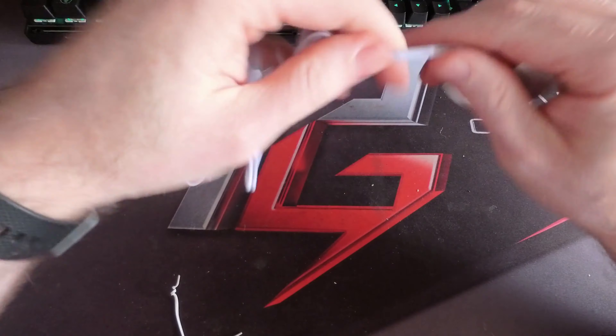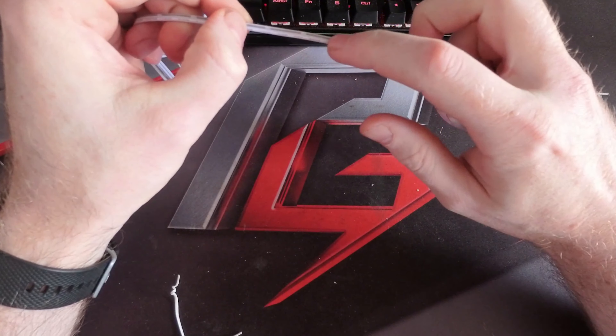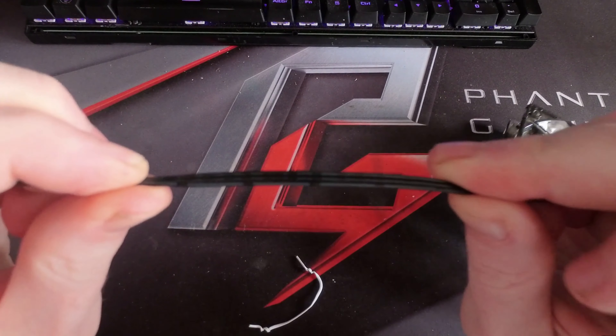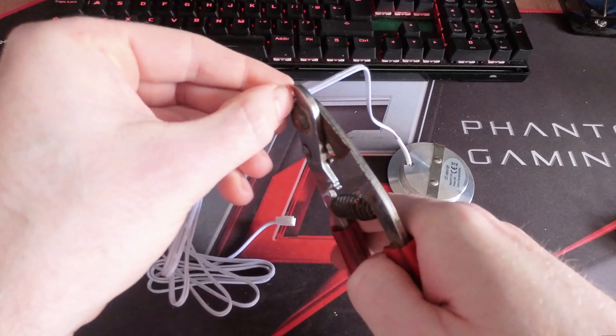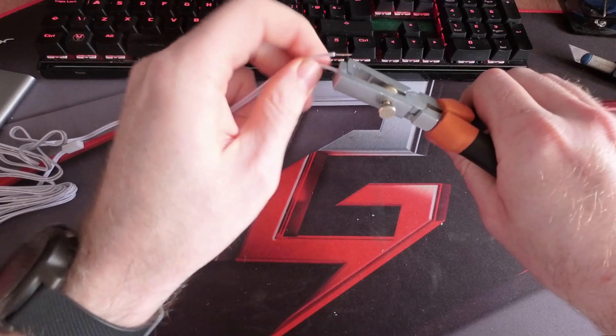Before I install a light I've got to do some prep work because these things have connectors and tons of wire on the end. I also don't know which one's plus so I've got to figure that out as well. I noticed one of the wires had a line printed down it — I'd actually seen that on the PC fan earlier so my thinking is that wire is the same and I'm going to guess that is the negative. So I need to test it out first with the fan and then test the light, then we can get to fitting.